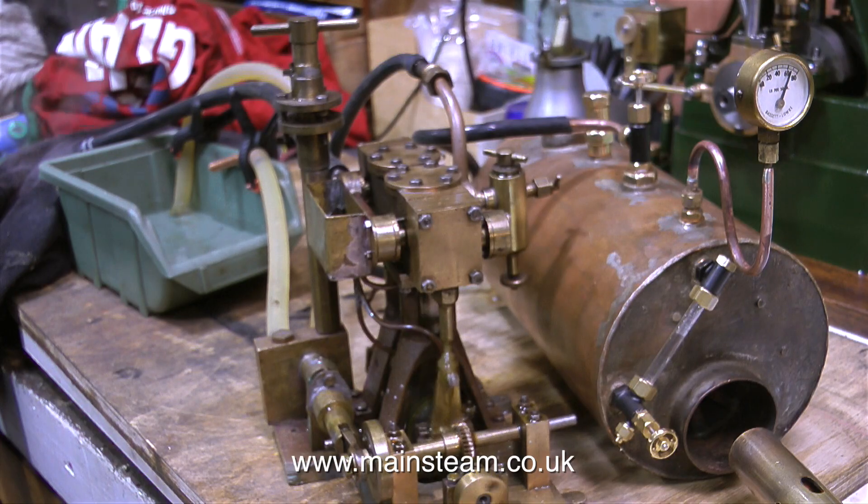This engine is currently running on 100% wet steam — that's steam straight from the boiler, which is known as wet steam. I will be putting a steam dryer in the circuit where the pipe to the engine goes back down through the chimney and reheats the steam before it gets to the engine. This is what I call a very successful steam test. Thanks for watching, and I hope you found it useful.